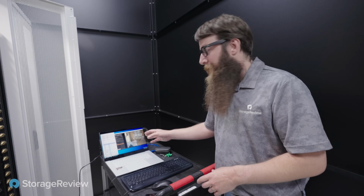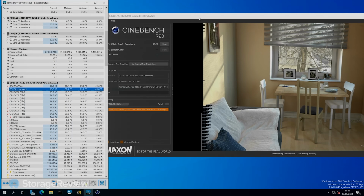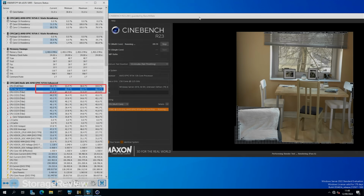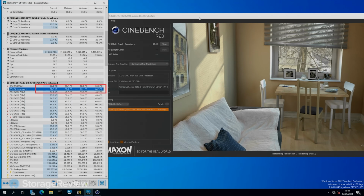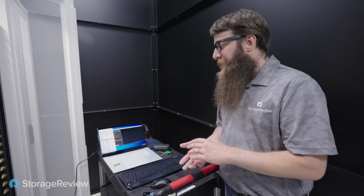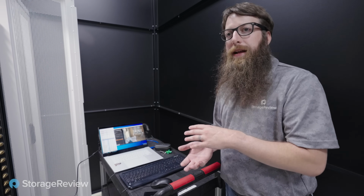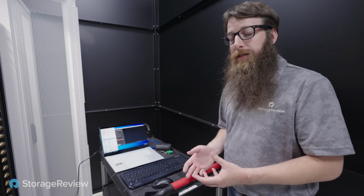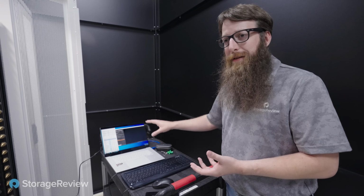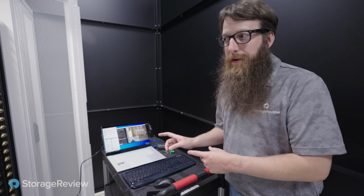We're putting up scores of about 120,000, but I think the most impressive thing is looking at our specs and hardware info while this thing is running. Our CPU average temperature is only sitting at about 80 degrees under full load, which means that the CPU can maintain full turbo as long as that temperature is maintained. Where you start getting in trouble, especially with air systems, and you start taking performance hits, is when that CPU temperature climbs a little bit higher and the CPU needs to throttle and pull power back in order to maintain the temperature. But thanks to the ZutaCore two-phase solution that we've installed in here, it's never really going to get much above that 80 degrees, even under full load, looping Cinebench over and over, so it can maintain the highest possible clock rates. Let's hit this thing a little bit harder and see what we can do to it.